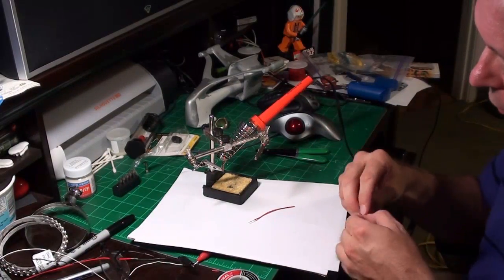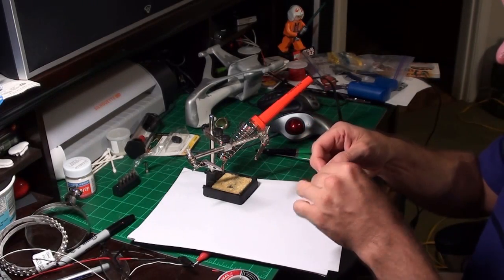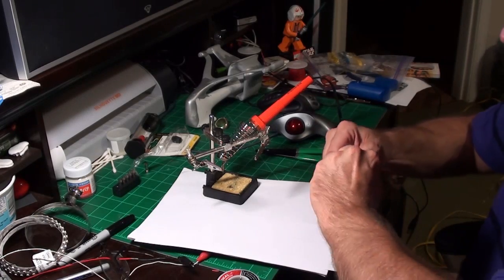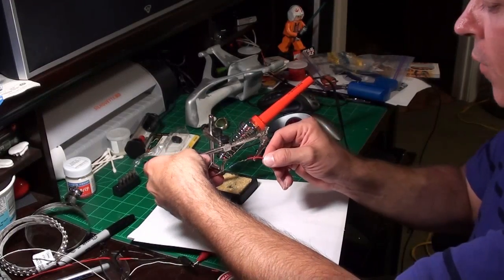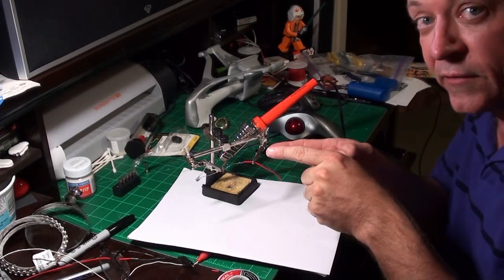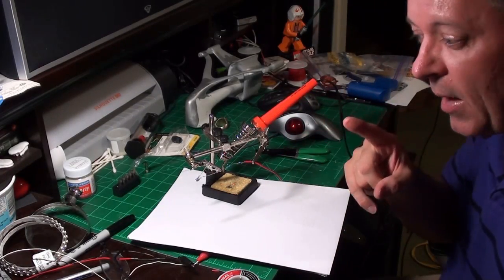Now I'm going to solder a piece of wire to it, repeating the same procedure. I take my wire and wrap the resistor lead around it — I'm trying to make a thin, tight little joint, which is better for heat shrink wrap. Speaking of heat shrink tube: put it on before you solder, because once the solder is on, it's a fatter joint and sometimes you can't slip the shrink tube over.